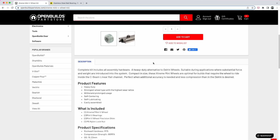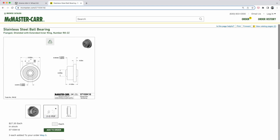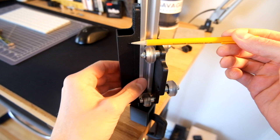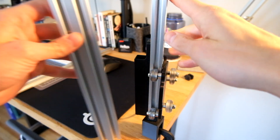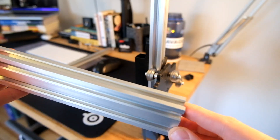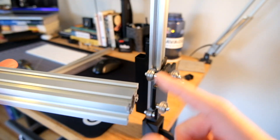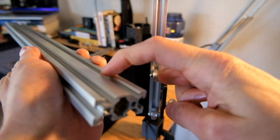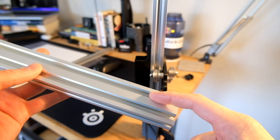OpenBuilds doesn't make a wheel that is nearly this small, and while I was able to find some tiny bearings that could be small enough to work, they're over $20 each, and I'm worried that the high cost would make this project less approachable for people. If I want to use wheels on this counterweight, I need a track to run them on, and I've just run out of track. Or have I? What if the vertical rail had two tracks? This is the 20mm by 40mm linear rail, also from OpenBuilds, and at double the width of our current 20mm by 20mm linear rail, it also provides double the tracks, which means we could potentially have a dedicated track for the carriage and a dedicated track for the counterweight.